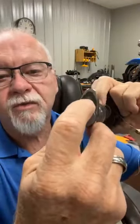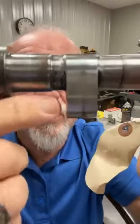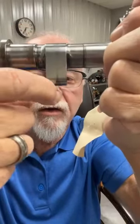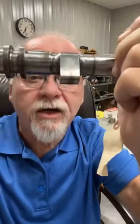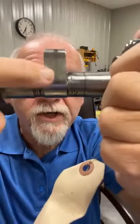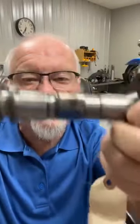So this is the original billet, and then he welded all this up with stellite. And I don't know if you'll be able to see it, but if you look really close, you can see where he would take a wheel and trench this lobe out. Kip at Cam Motion trenched this lobe out and made a big trench, and then he welded stellite in here and ground it back. Can you see the fill? It's like a different material inside the lobe that's shaped like a U right here. But that was the only way we could get this to last for 20 runs.